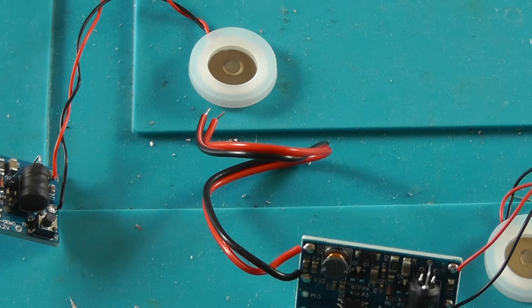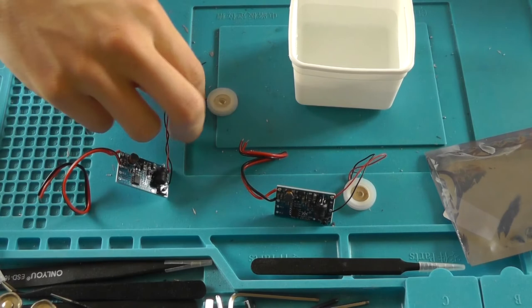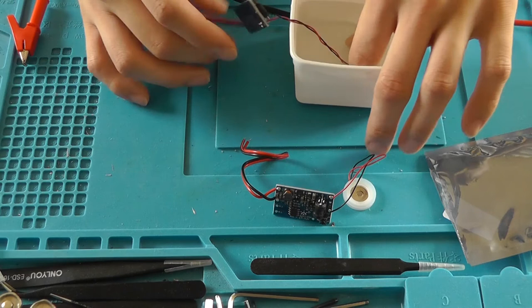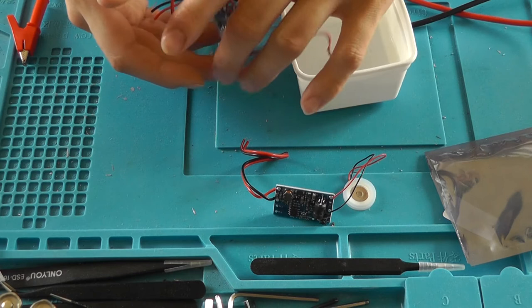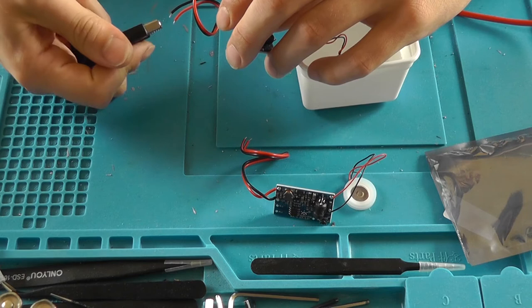So I'm wondering, do you just float them on the water? Because I can imagine that the device will start to rust because of the contacts that are at the bottom. Now, I'm hoping that I'll be able to PWM this thing and control the fog generation in that way with a MOSFET, because I don't want this thing to be on all the time.